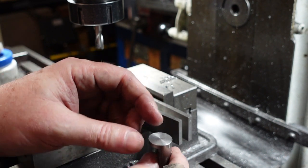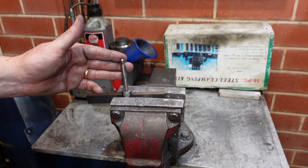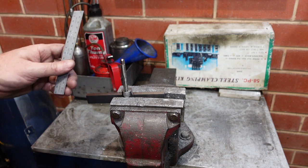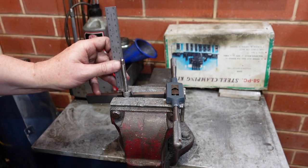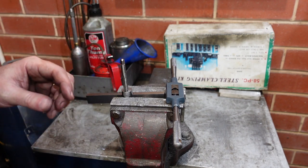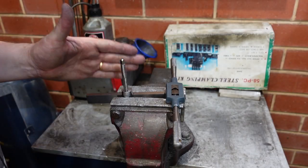Once I've done that I'll be putting a tapped hole in there that will hold the tap shaft in place. Here's one of the pieces I've just been machining — I've drilled a hole and I'm going to tap it for the grub screw. The way I do it is I start the tap with the tap wrench just a little bit, then I check how square it is using the edge of a steel rule. After a bit of practice, once you've got it right you can continue around, provided you keep equal pressure on the arms of the tap wrench.